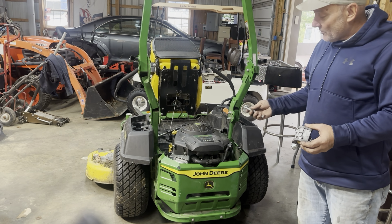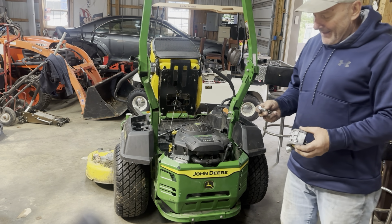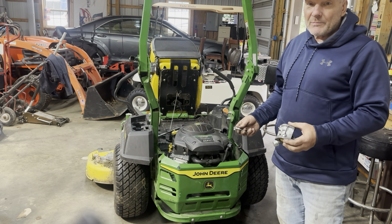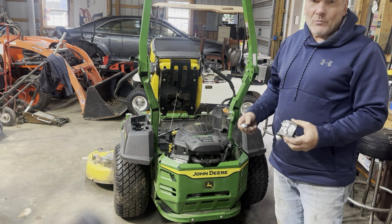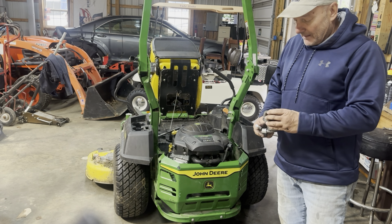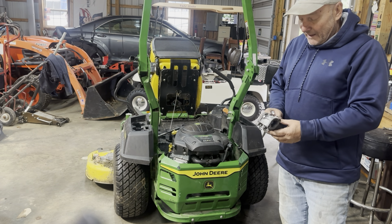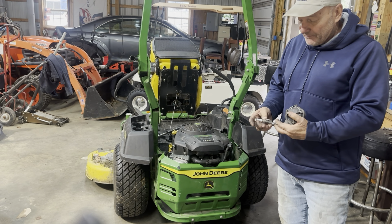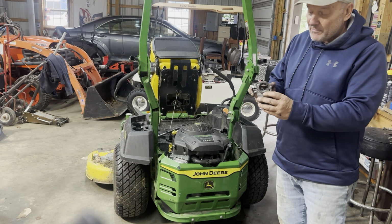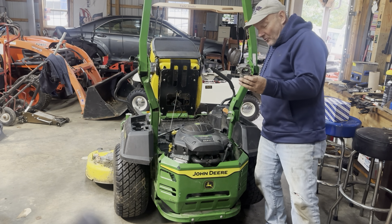We were able to start it up, get it choked, and make it work. That was the initial test of it. And then once it got cold, this became the problem. We tested it, choking it, and it wouldn't start. So I went back and looked at everything, and then just today, we swapped out the butterfly on the carburetor, the back choke section of the carburetor, that's manually controlled by a switch here on the control panel of the unit.